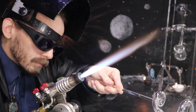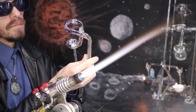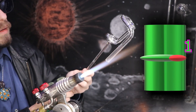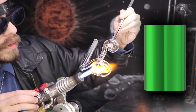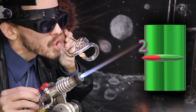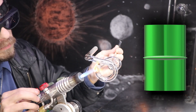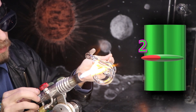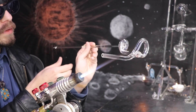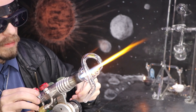Now that I have both sections connected, I'll let it cool for just a moment and then come back to melt out the seam. I only want to heat one third of the seam at a time — the other two thirds will support the weight of the second tube and help keep the walls from collapsing. I also need to give it a slight puff to move the glass around and even it out. I may have to go around more than once, heating and puffing about six or nine times, but this should leave me with a very smooth channel.